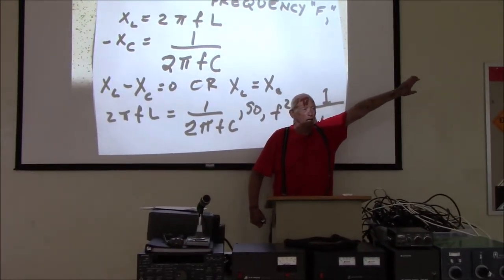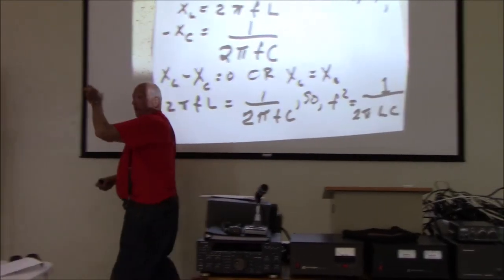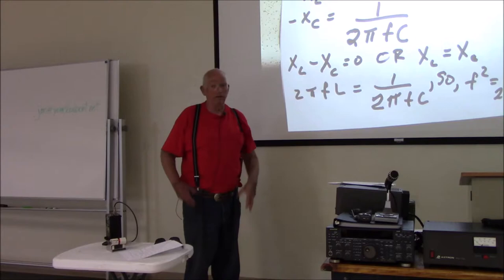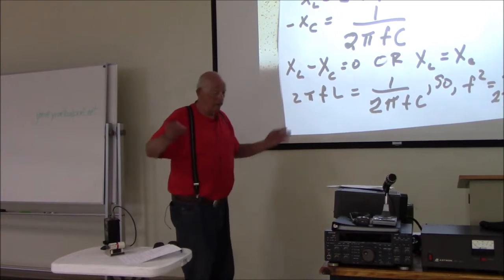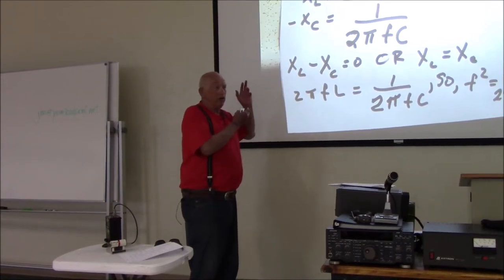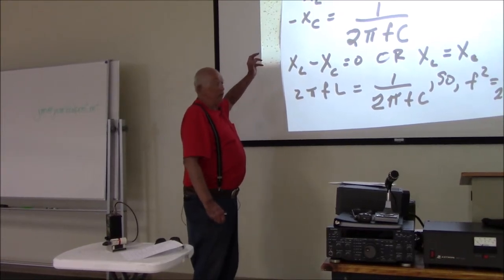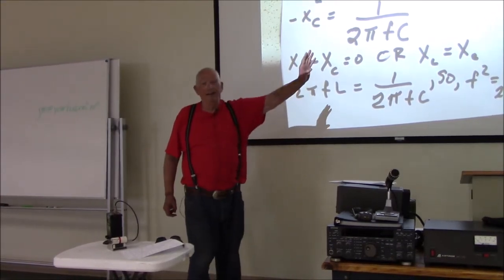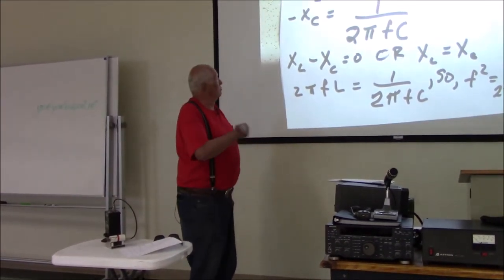And then that kinetic energy gets transformed to potential energy, and it starts to fall again, and it swings back over here, and it oscillates. And that's what a radio circuit does with inductance and capacity. It's the same thing. The current going through the inductor, induced by the collapsing field in the inductor, creates the current flow in the wire that charges the capacitor one way, and then as that charge builds up, it bucks the flow of current from the inductor, and pretty soon the capacitor starts to discharge through the wire, and the next thing you know, the electrons are going to the other plate. And so it oscillates back and forth.